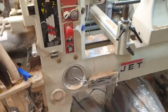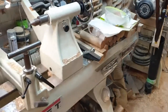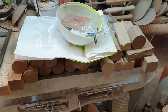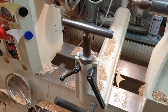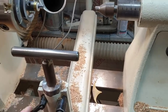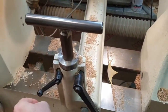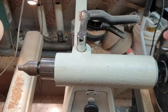Now the Jet 2424 short bed — this also has a bed extension. I got tired of lifting off the tailstock unit, which is something in the region of 30 kg, so basically all my machines have bed extensions now. They make a huge difference. The banjo on this is absolutely terrible — initially it comes with a grub screw and I added a second handle. It is very heavy and awkward to move, so when you're trying to get something done quickly you find it very hard.